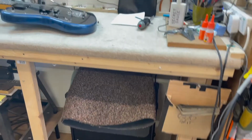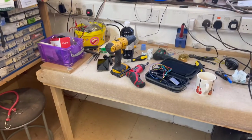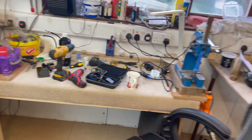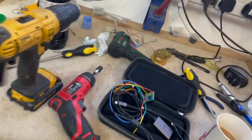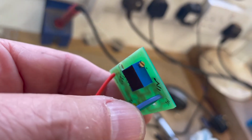And that means putting the scratch plate on with all the preamp underneath it, putting strings on, testing it, switching the switch. Oh look, it's not working properly, what's wrong? Do I know what the volume switched to? No, I don't, because there's a little trim pot underneath. So even if you could get it working, this little trim pot here means you can't set it.